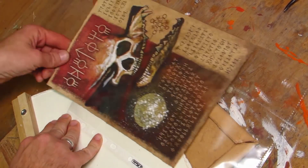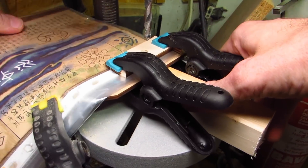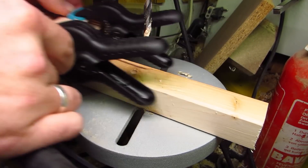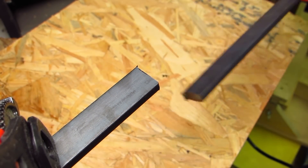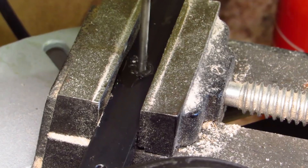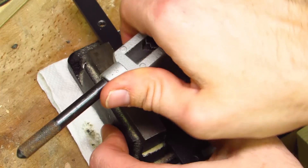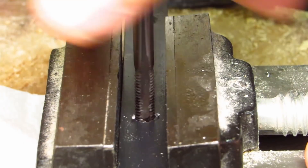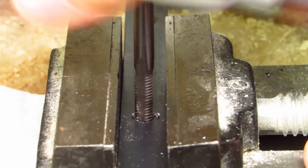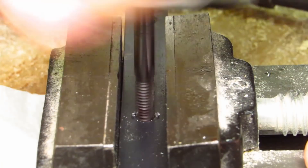Here they are, in all their glory, and they got the same sleeve and tape treatment. Then I used the plywood pieces to mark where I need to drill, but behold — instead of the plywood clamp I decided to switch to metal. I cut this flat stock to size and drill holes matching those already present in the sleeves. One side gets through holes, but into the other I cut matching threads for the screws, making sure to move the thread cutter backwards every so often to break the metal shavings. Spoiler alert: while this came in handy, it was not at all necessary for the final result — good practice though, and it did help a little bit.